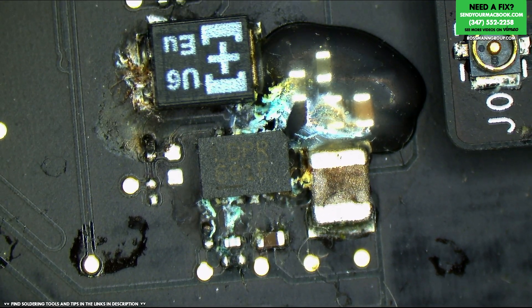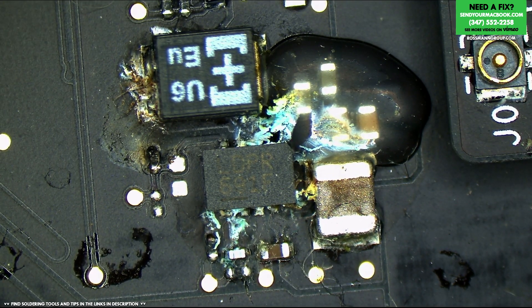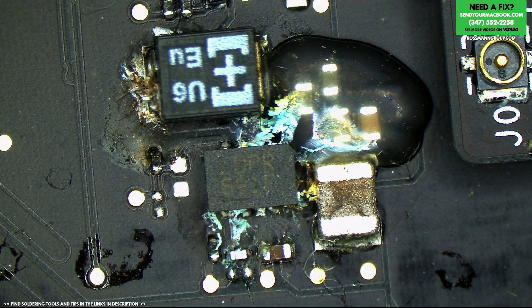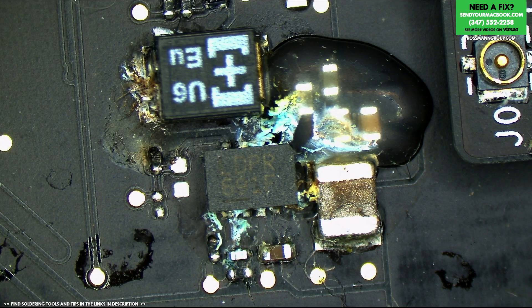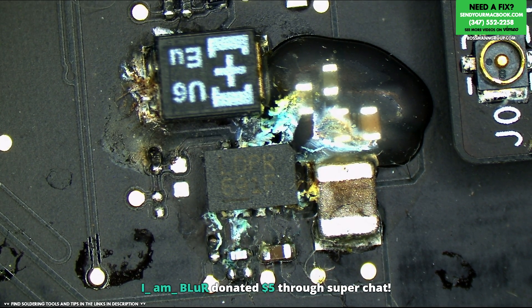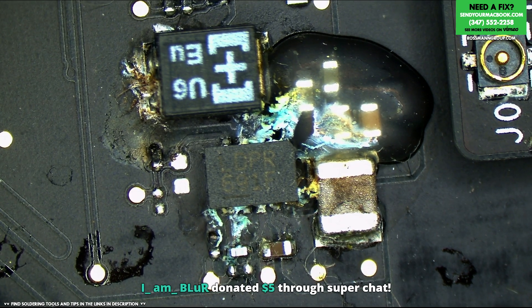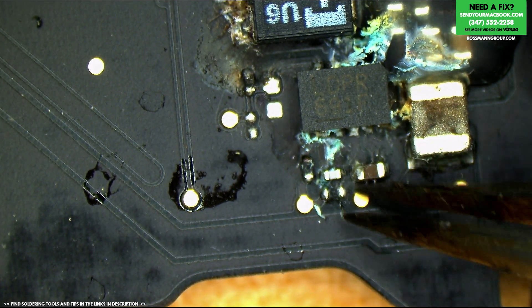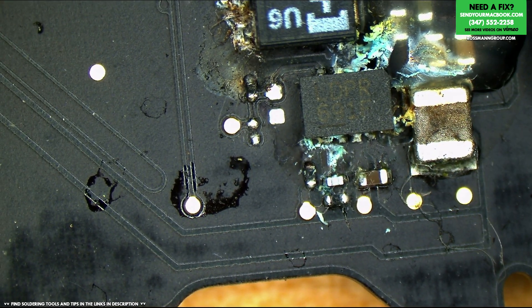There's a lot of corrosion here, but can anybody tell me what the actual relevant part of the corrosion is, and also why that part of the corrosion is relevant if you can follow along to the circuit using OpenBoardView on screen? This resistor here appears to be the worst off. Let's see what happens if we were to simply hot air it.